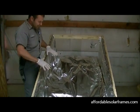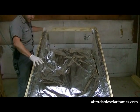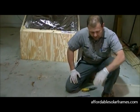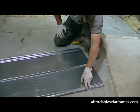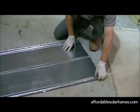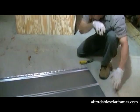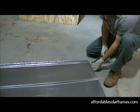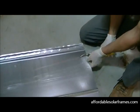Next we're going to line it with some tin. For the inner lining we're using galvanized roofing material. I've flattened out the edges so I'll be able to staple it into the frame. It's a little bit too long so we're going to take some shears and simply run down it.